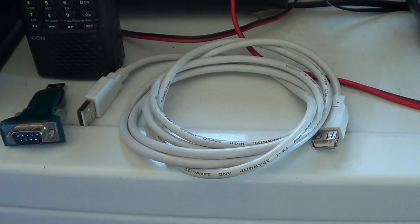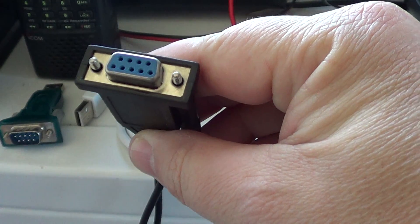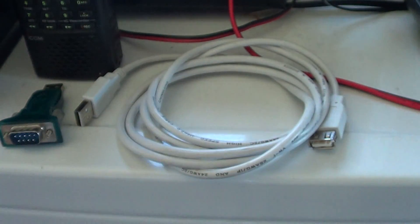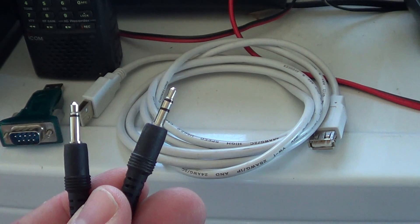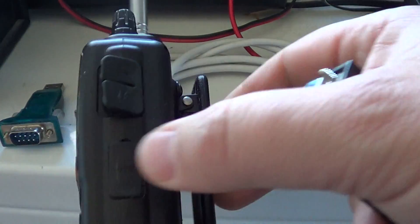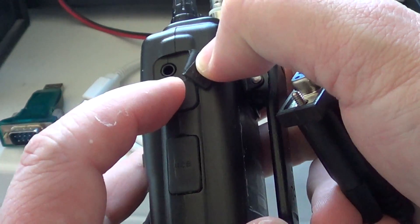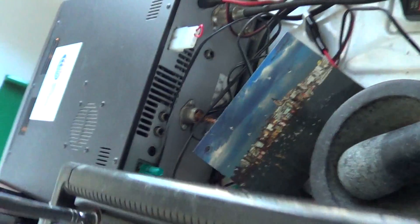If you want to control the ICOM ICR-20, there's a little twist. You will need to find a special ICOM ICR-20 cable, and here is what it looks like. You've got this DB9 plug and it has two wires coming out from it. One is for computer control and the other is for audio. If you look at the ICOM ICR-20, your CIV connector is right here — the CIV or CI5 connector is actually the same connector that you have on the R8500 right here.